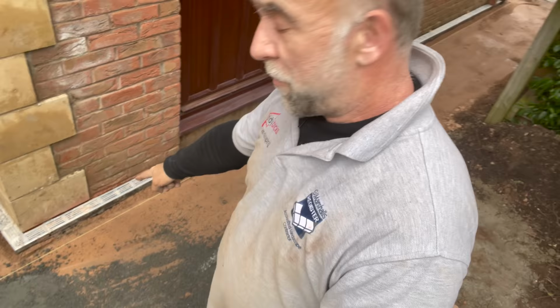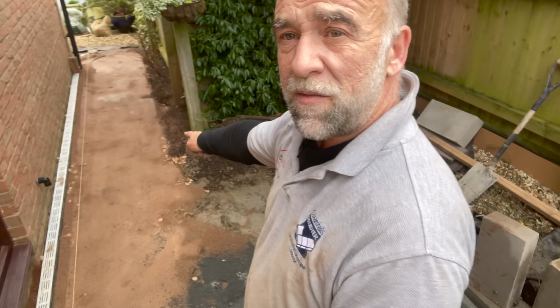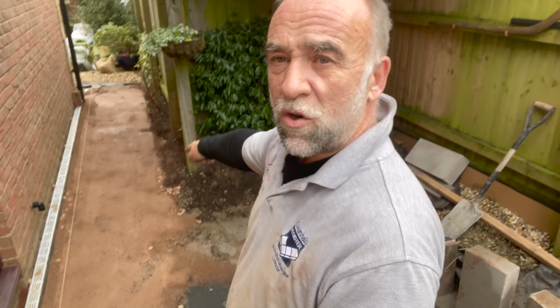So threshold, we're gonna have a 50 mil strip of the buff, then we're gonna have a 50 mil strip of the cort and copper, then we're gonna go back into the buff, then on the opposite side of it, follow my finger, that'll be the same again. You'll have the buff in the middle, then cort and copper, then buff, then for the outside. It just gives it a little bit more. If you don't have a border on it, it's just boring. Stick a border on it.